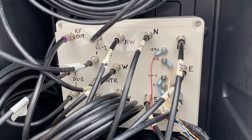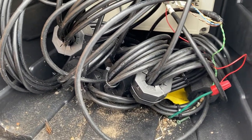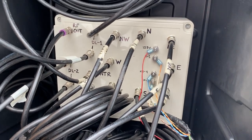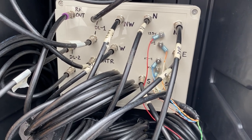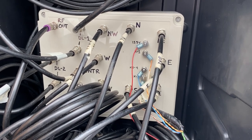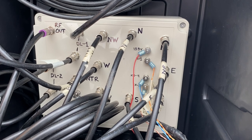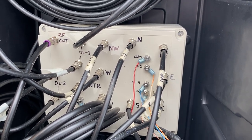Got the box hooked up. You'll notice I haven't bothered yet to remove the type 31 toroids — it's kind of cold out here, so that's a project for another day. I'm going to see what the performance is like now, if there's any change at all. By the way, the new layout with the larger footprint on the board makes it a lot easier to get access to the F connectors and reach in between and tighten them. Make sure you get your 7/16 inch wrench out and tighten these F connectors really well — that's important. Loose connectors are a real problem with low output receive antennas.